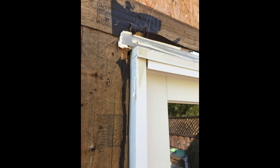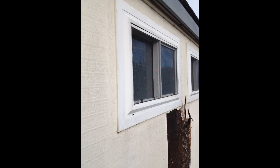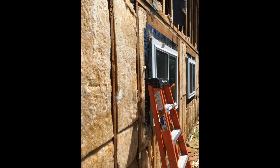Here you see a picture of another block frame. It looks like this was in a patio door application where they did not have a nail fin, and they tried to use some snap-on Z-bar at the top to try to keep the water out, but it did not work. Here's a common application of a replacement fin installed right over the top of the siding. This is a poor design, as you really rely on caulking. When that caulking fails, the water can get into the home quickly, and that's why we had to replace both the siding and the windows there.